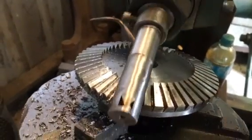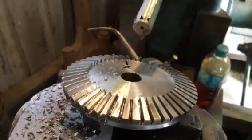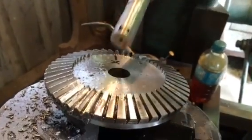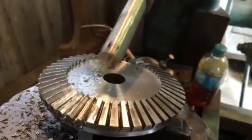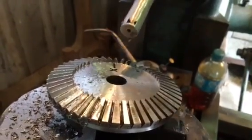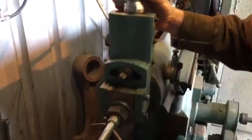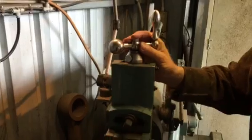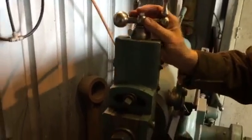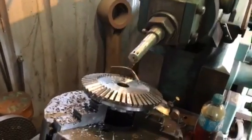You can do jobs like this fairly quickly. These blanks were roughed out on another machine and we found they suit the purpose that we're wanting to do — diff gears for a 3-inch traction engine. We're just using a single point tool just to shape the teeth out. I'm just giving it a little bit of a down feed on the top slide on the back of the stroke.